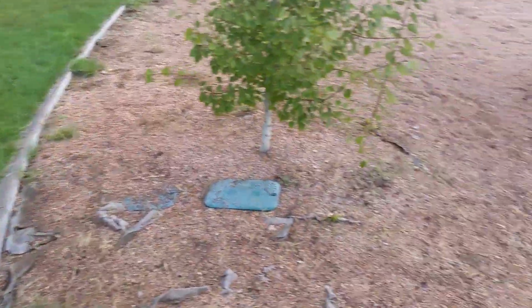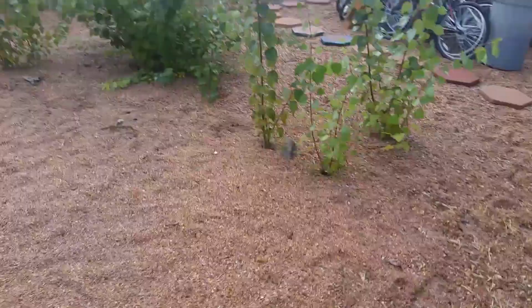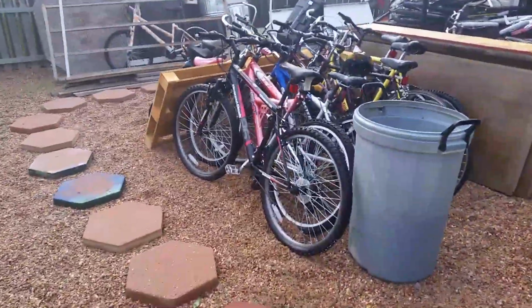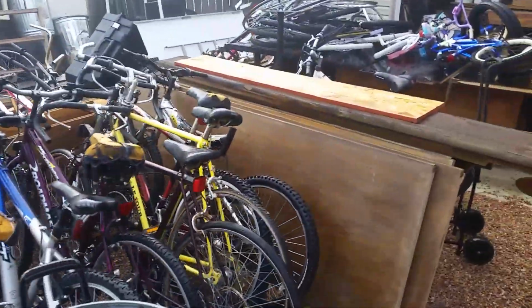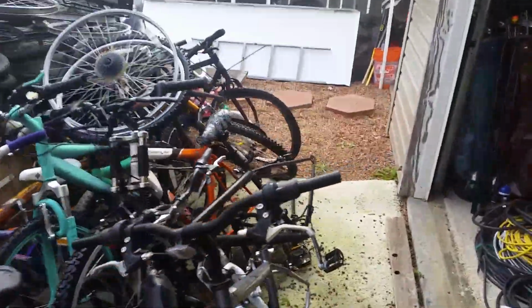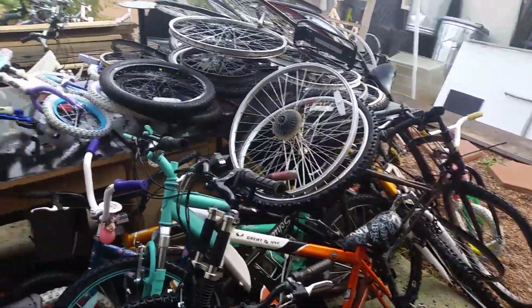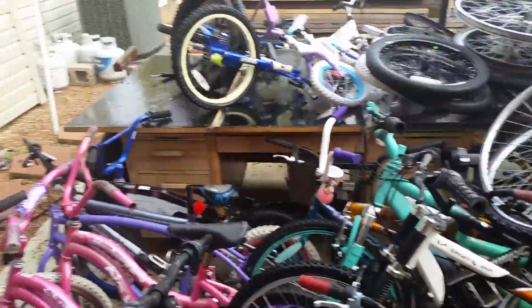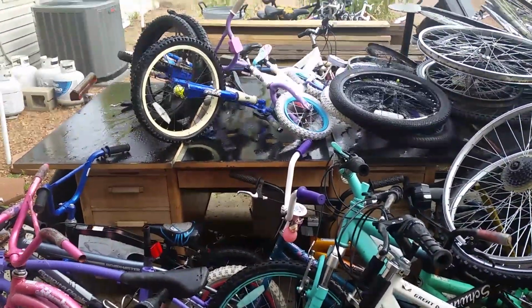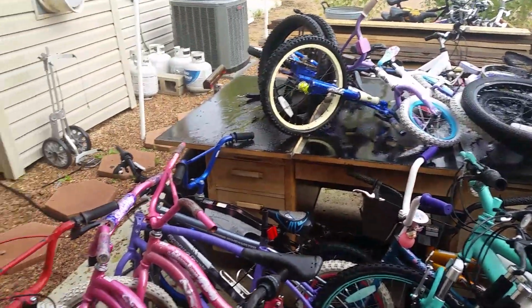I'll probably redo 1 because it's my lowest sprinklers on the whole system. And by now I'm sure any water left in the pipe is drained down to those guys, so I could probably get some more out of it. And that will basically be it. I will probably blow through them again just to make sure I got them all. I think we're at 45 minutes, maybe an hour, so it didn't take that long.